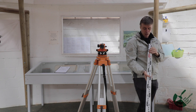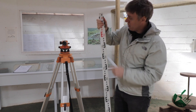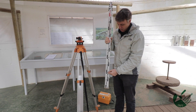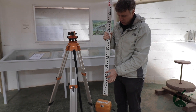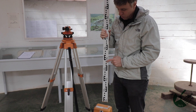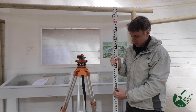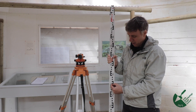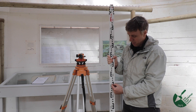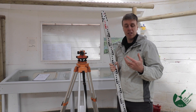The staff is a simple piece of equipment that extends up to a maximum of five meters. The first increments are meters, then ten-centimeter increments (0.2, 0.3, etc.), then five-centimeter increments shown as solid boxes distinct from unsolid boxes, and then centimeter increments as individual boxes. In reality, this instrument is only accurate to about five millimeters. So if reading at 0.30, the next box would be 0.31, 0.32 — but you'd be estimating whether you're at the top, middle, or bottom of a box; for instance, 0.305 would be the middle of a box.